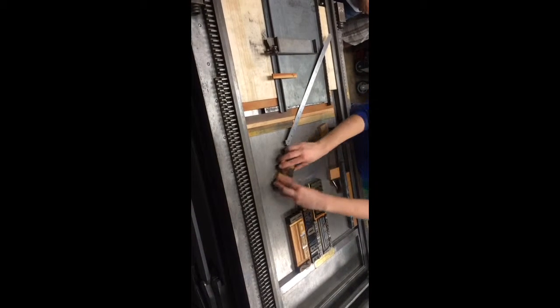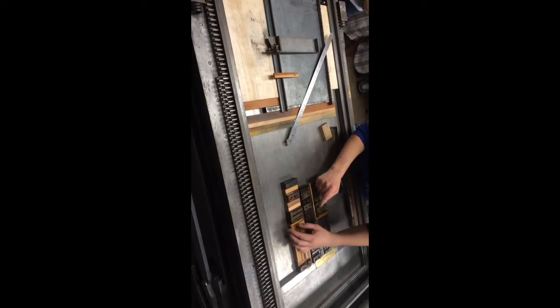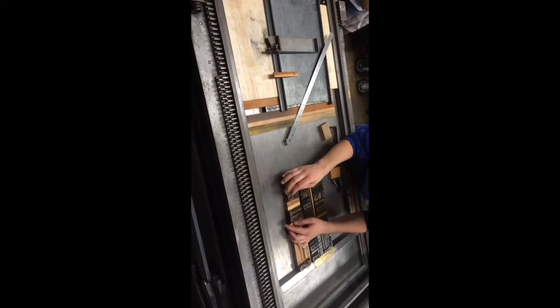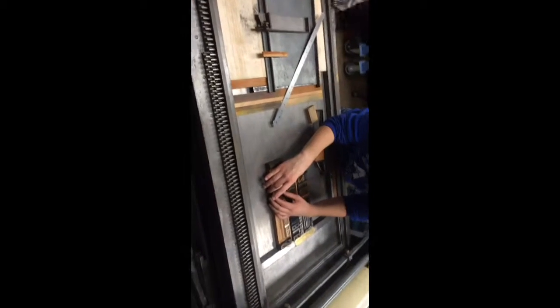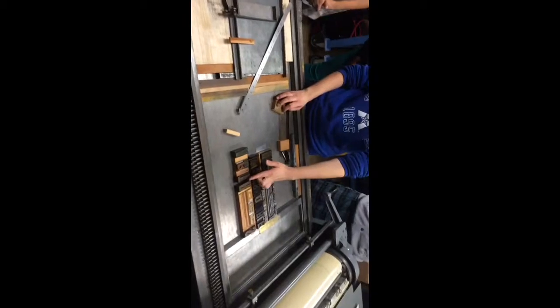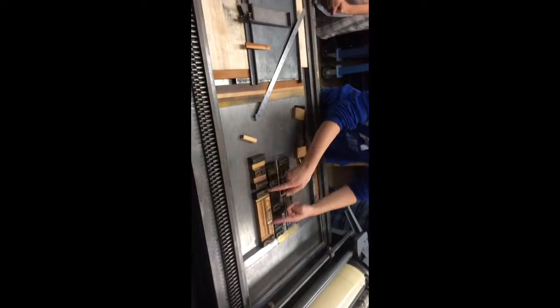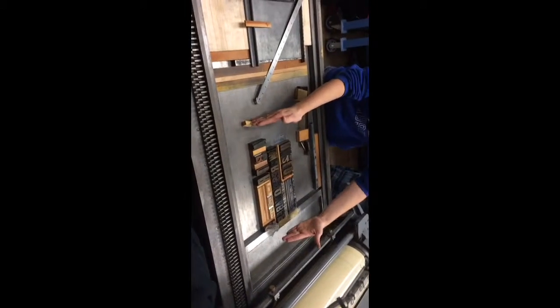What I would do — this is 30 without these end pieces — so that gets us closer. I'm going to take these off so we can fit it right here. Then we're going to get real creative. Can you pull some 15-pica riglets? All I'm doing is adjusting the spacing to make this fit on the line.